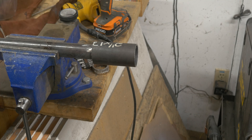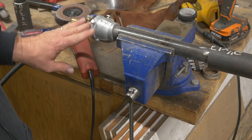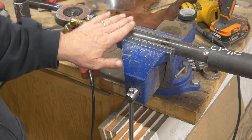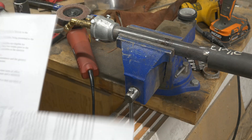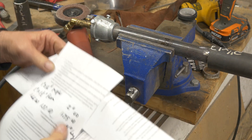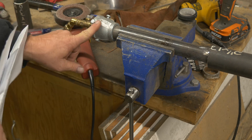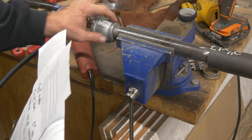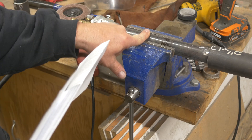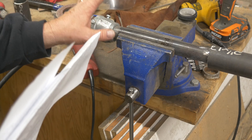I am very happy with that — that's going to work great. I don't have to change anything on this end of the burner, so my valve and my nozzle — which is a welding tip — can all stay. Let me tell you what I've got here, and I'll put a measured drawing in the description. This is a one-inch to inch-and-a-half flare plumbing fitting — just a plumbing fitting you can get at any hardware store. This is a 12-inch by one-inch nipple — that's what you're looking for at a hardware store.